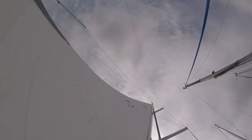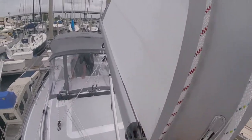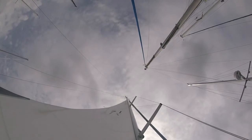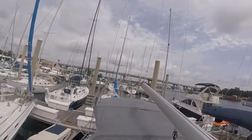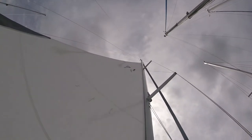We've got the outhaul pretty much adjusted all the way out. The sail looks nice and we're going to roll the sail in and out a few more times, and shortly after that we'll do a little bit of work with the Genoa as well to make sure it's rolling in and out well. Rolling it back up — easy out, nothing to it. Rolling it back out one more time so you can see we have both clutches open and the sail comes right out, except for the batten at the top, which is normal.